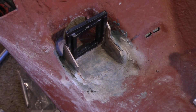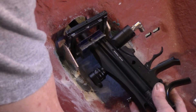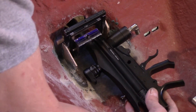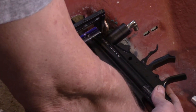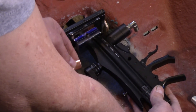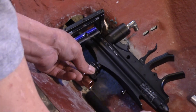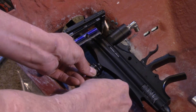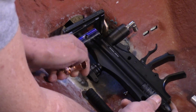Next we'll be drilling the holes, and I think I've got the feed system figured out. That's a very close fit right there, which was by design. With the paintball cannon sitting about like that, I've got this tube — I've already checked it, the paintball rolls down it like a dream, no problem — and a copper elbow that I'll have to adapt for the gun. I think that will run up to this door back here for feed, with at least 10 paintballs fitting in there, and it should be easy to reload.